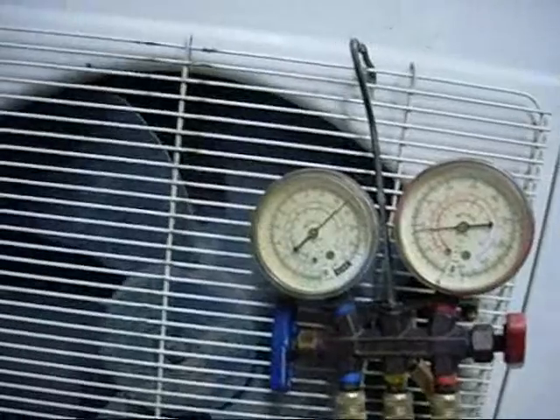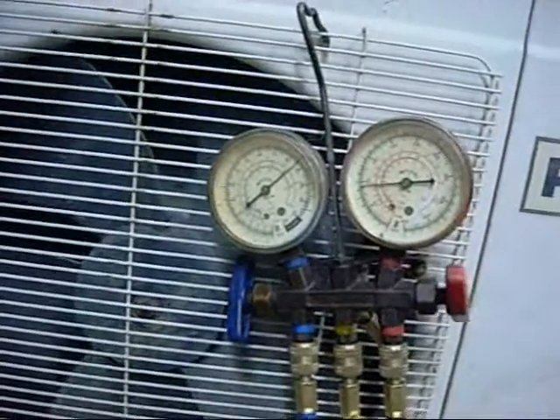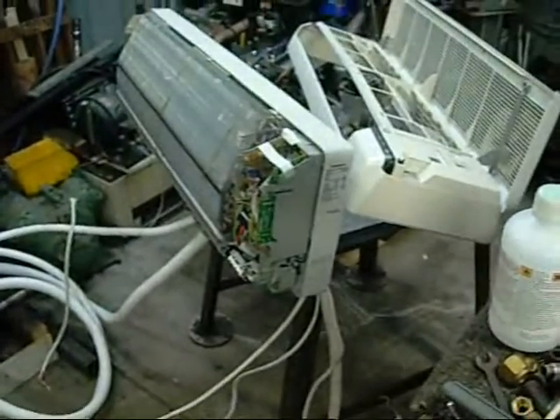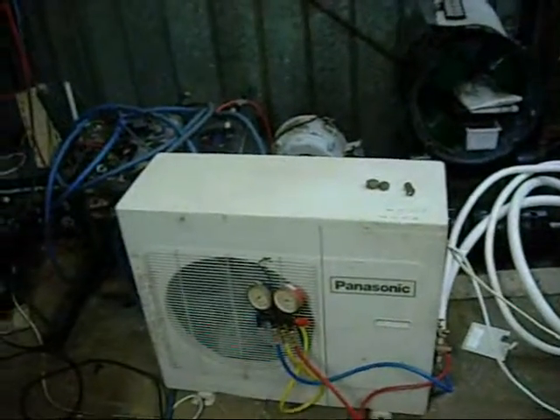85 PSI and climbing — that's good. I want roughly 105 to 110 PSI static pressure. I'll know when it runs if it's a bit low, but I've got access to reclaim refrigerant to top it up if I have to. Or better yet, just spend a few dollars and use some new stuff. We'll see how well it runs first though.